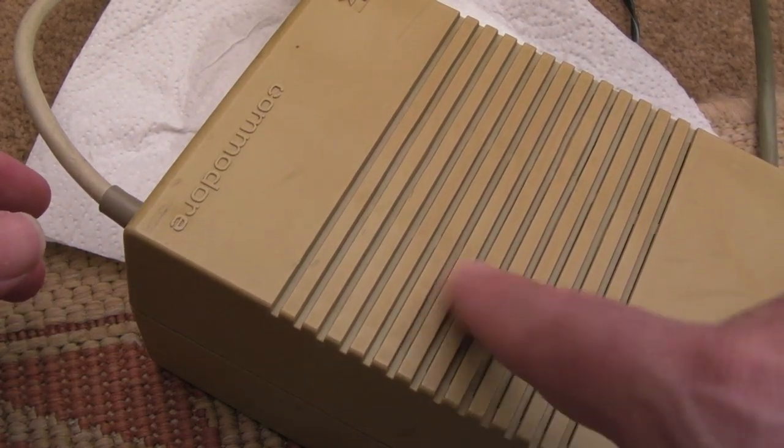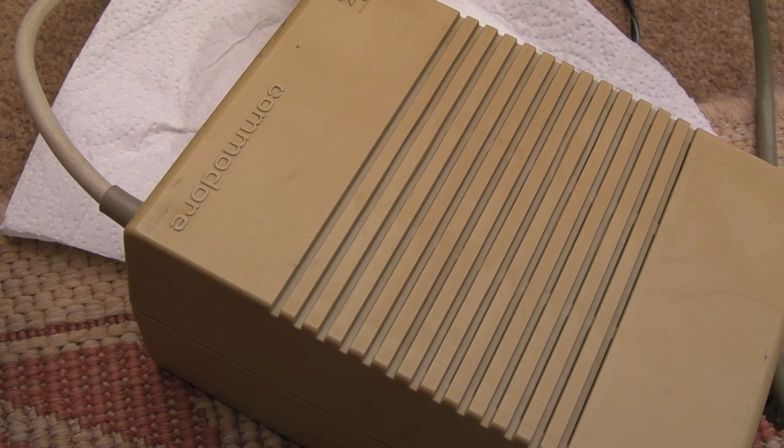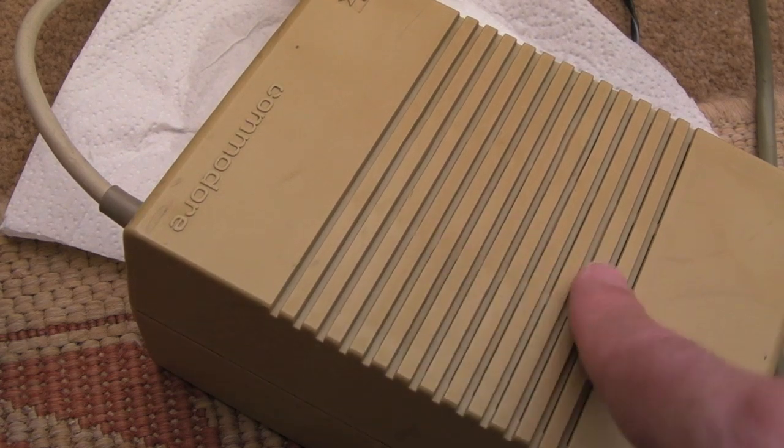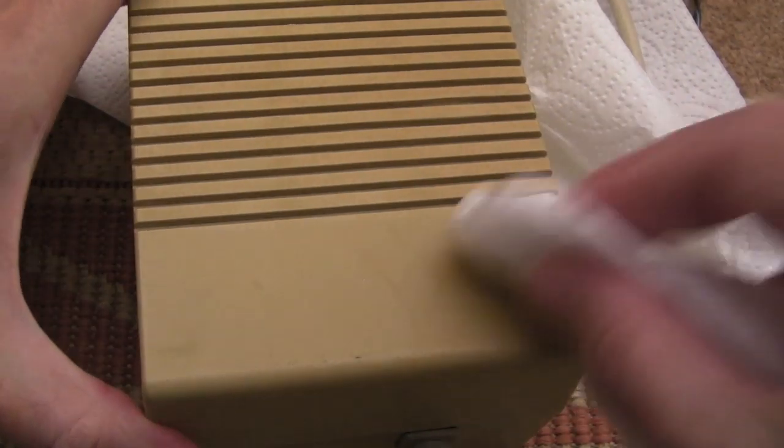As I say, where those two resistors were, the board was a bit charred, often those will burn up. So it can be difficult sometimes if you get one and both of them burnt up, understanding what size resistors go there. But as you saw on this one, the two were both 47 ohms, I think, on this particular power supply. So we'll try some IPA on there.